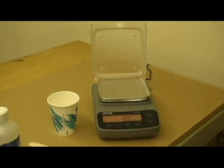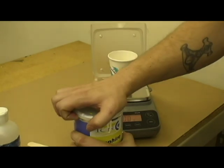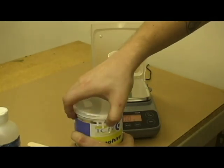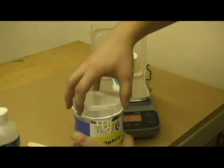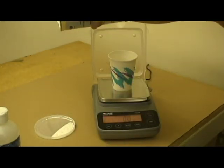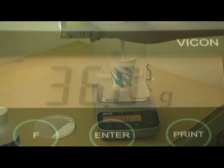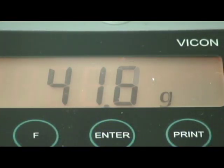Place a cup on the digital scale and set it to zero. Start by prying off the lid of the can of ink. Pour the ink into the cup, keeping a careful eye on the scale. Typically 50 grams is enough for a 90mm ink cup. Sometimes white ink will need 60 grams because it has a heavier pigment and you want to make sure you fill the cup most of the way.